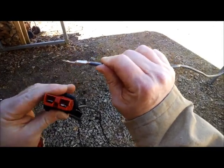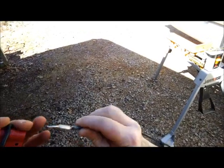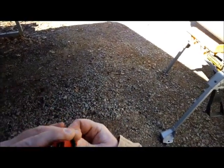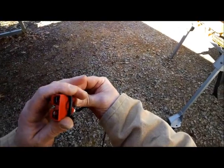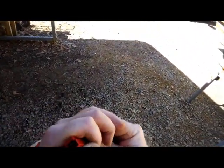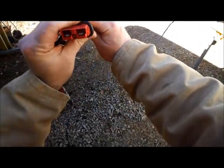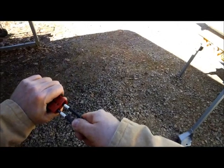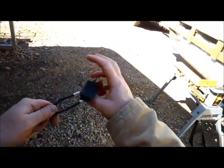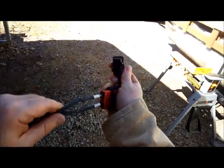There's a little tab in there, and by design when you push this in, it's going to hook itself onto that tab. I'm going to push that in there — and now you can see both tabs in there and they're hooked. With that solid crimp they're pretty solid, and there's no conductor showing — it's way in there, isolated.